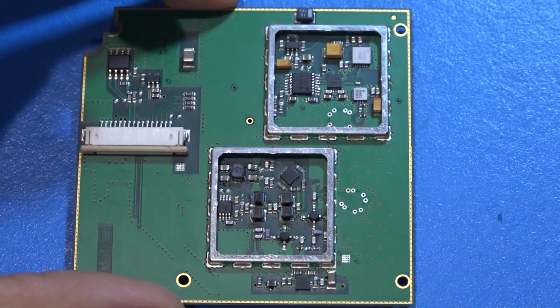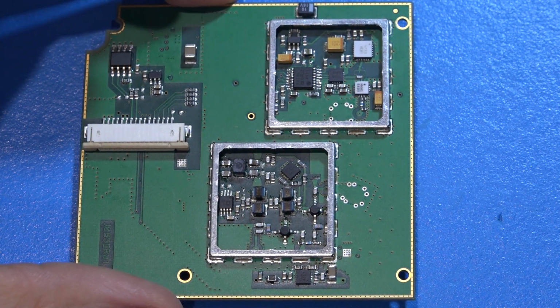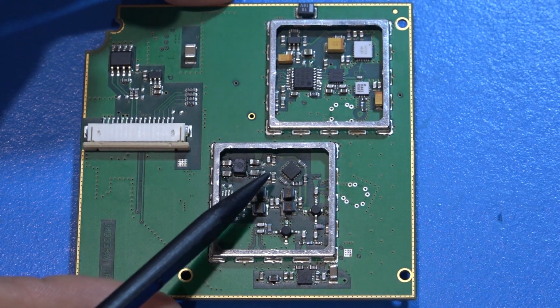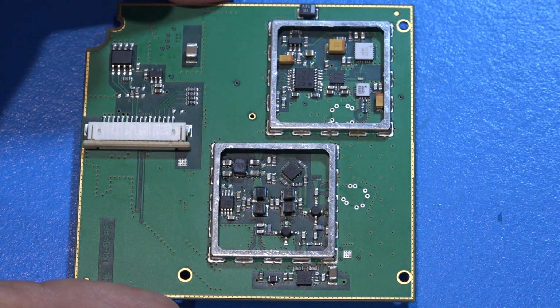Now, I don't know exactly why they're doing that, but my guess would be that they're using that to be able to do signal ID detection, so they can distinguish the image from the real signal by moving the LO around and looking at the power detected in the two power detectors. In the way in which they change as you change the LO frequency back and forth, you might be able to tell the direction in which the image is moving, and then therefore you can tell where the actual power is and remove the image from it.